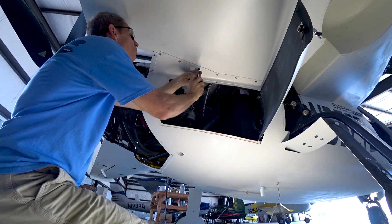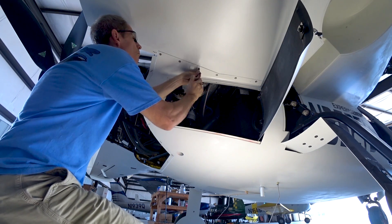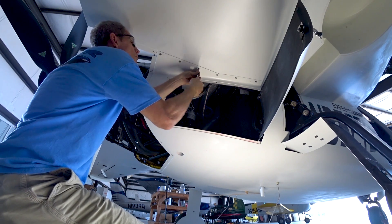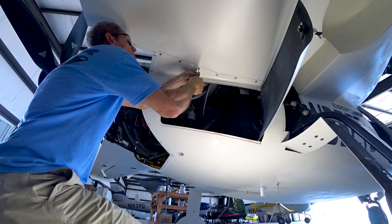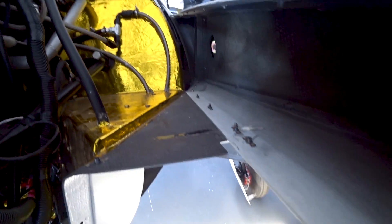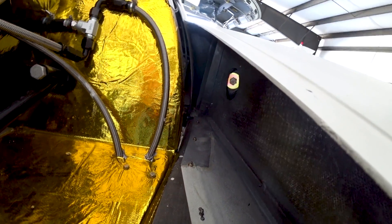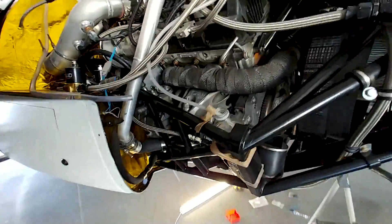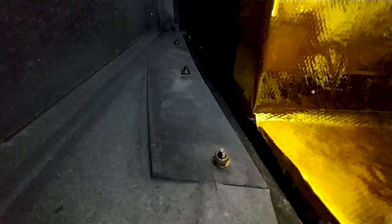Getting close to finishing off. I still have to do some more things around the baggage compartment — some of the wiring in there still needs hard mounts installed to hold the wiring looms in place so they're not flopping around. There are a couple more similar things to do in the engine bay as well. But you just work through your list and get things done. You can see the first three with nut plates — one, two, three — and the front ones have a washer and nylock on them. I've already done the ones on the other side, so that's out of the way.